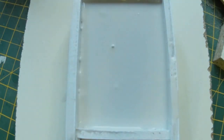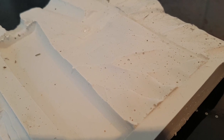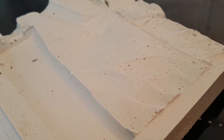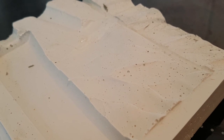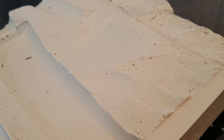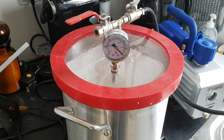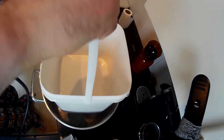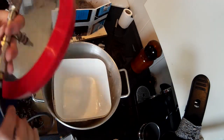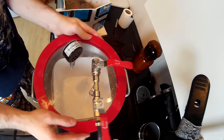The air is introduced when you mix the silicone up. The problem is that air bubbles on the surface of your mould can give you distorted casts with bubbles where you don't want them. Here's a cut section of a mould I made previously that I didn't degas — as you can see there are lots of cavities inside, which is a problem. The way around it is to use a vacuum pump and a vacuum chamber to suck the air out of the rubber before it cures. They're not the cheapest items but they're not hugely expensive either, and I do recommend getting one as it really does improve the quality of your mould.